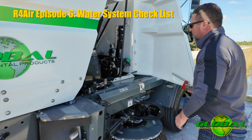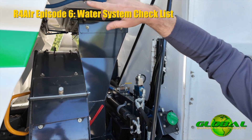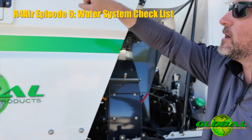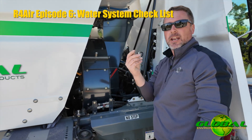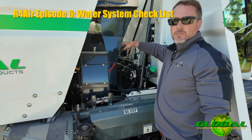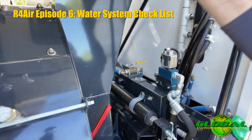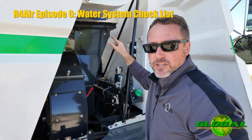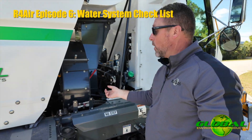To the inside of this panel, you're going to see a blue water line with a ball valve that's actually injecting water to the regeneration intake back into the fan. Because the air in a regenerative air sweeper actually regenerates — running in a loop through the entire machine — we want to use as much water as possible without creating too much slurry to make sure that dust and anything that could clog your fan housing or damage your fan is knocked out before it gets there. Global equips the machine with a ball valve you can turn on or off. I typically recommend keeping this one on to inject a spray mist at the top of that neck at the intake, so that as any debris makes its way through the dust separator, it will catch and contain that dirt — and instead of going back into your impeller, it'll drop out towards the bottom of the fan housing. We do have an access point to clean that out.